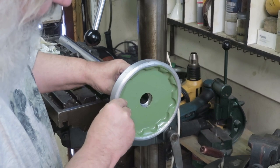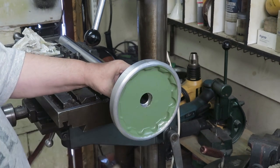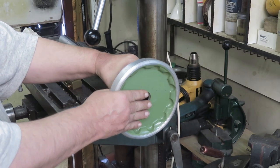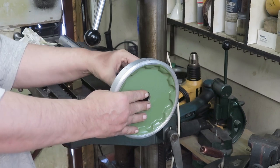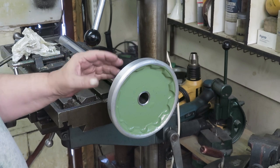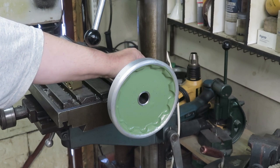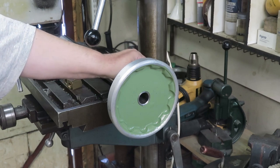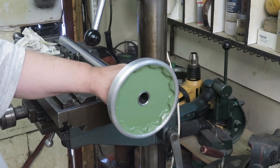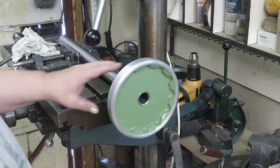But it was sitting so. You see, it's not fully engaged. So I will make that thing that much shorter, and it's nearer the end of the machine. And remember, this wheel is rotating 3000 RPM in the backside. So it has to be quite straight, so the machine doesn't start to walk around.